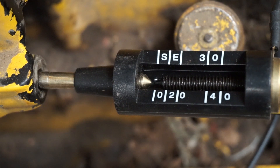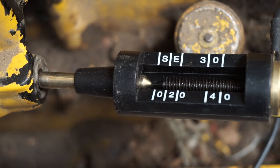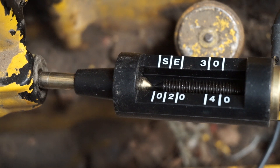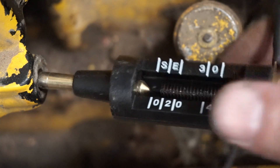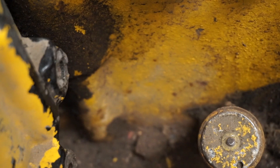Let's have a look. Great thing about it is you don't have to wind it very fast because of the springing action I showed you earlier on - you don't actually have to wind the handle very fast to get it to flip over. So let's have a look. Oh! That's a nice big fat white spark! I'm sounding way too excited about that. Lovely. With a well-working magneto you get such a lovely big fat white spark out of them. Let's try out the other one. There we go, look at that! Oh, it fell out, but it's done its thing. Wonderful. One working magneto.